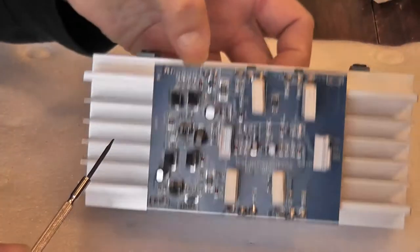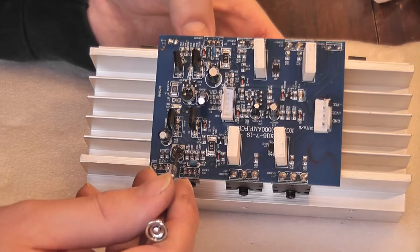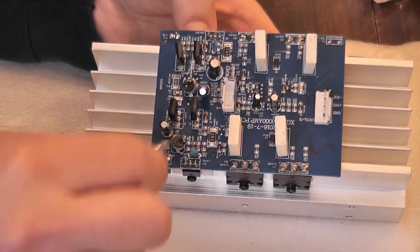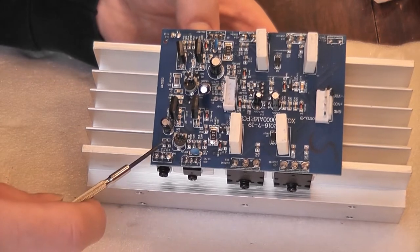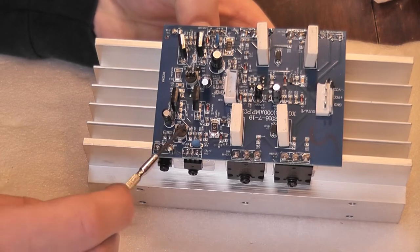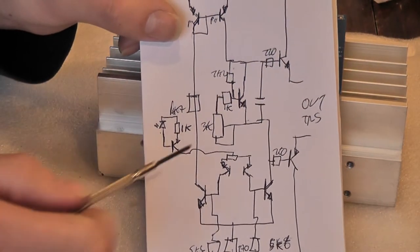Normally you get little burn marks on them. So those two resistors are suspect on this amp. In a previous video I said the bias circuit wasn't adjustable - turns out I was wrong. It is adjustable by millivolts. The tracks which look like they're joined are joined, but there's actually another connection you can't see. I had to pull the pot out to measure it - it's only a 300 ohm pot, though the board says 3k.